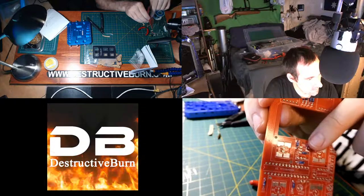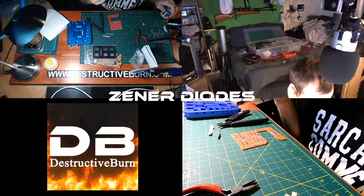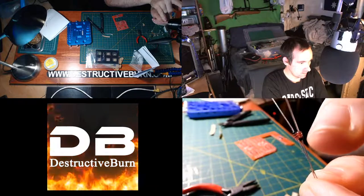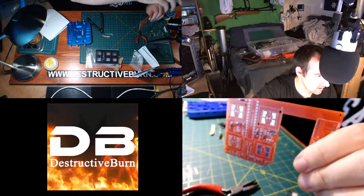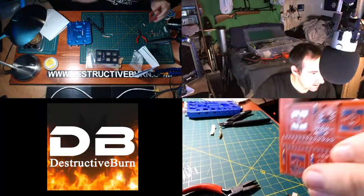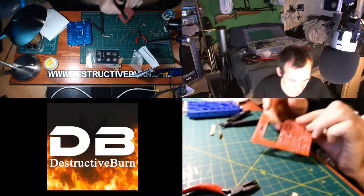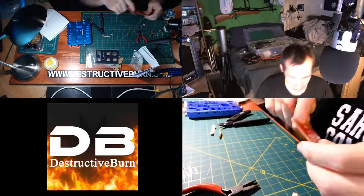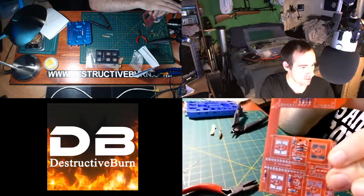So I'm going to do the diodes now — they're almost like a glass type of diode. We have a black mark on both of them, and you can actually see those marks on the board as well. They have to face that direction. So just to show you — you can see what direction the black mark goes. Do the same with the other one, and as you can see I bent them as well.